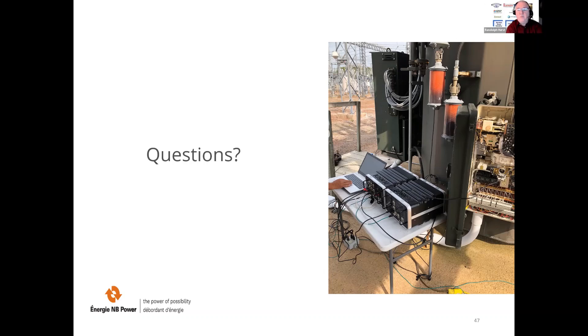Is vibro-acoustic analysis also used in other applications besides transformer applications? Yes — the accelerometer has been used for more than 50 years and impacts are recorded through accelerometers in applications like turbines. The vibro-acoustic method using the accelerometer is also used for breakers to record impacts. I have done a presentation on vibro-acoustic applied to high-voltage breakers at an Electricity Forum event. The advantage of the accelerometer is it acts exactly like a stethoscope — you get the signal, and Hydro-Québec developed the envelope approach to simplify what is otherwise a complex signal.